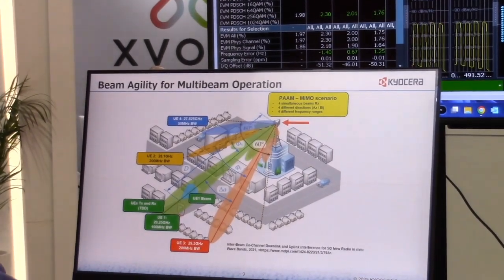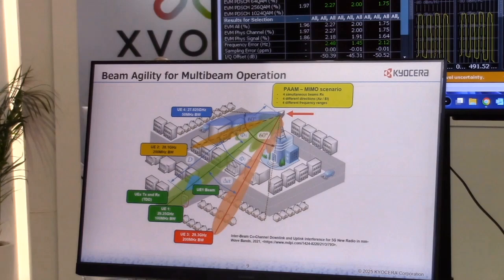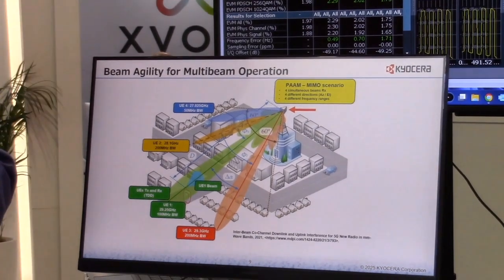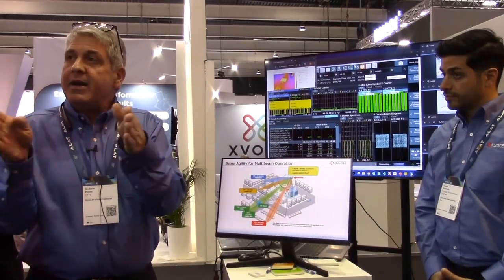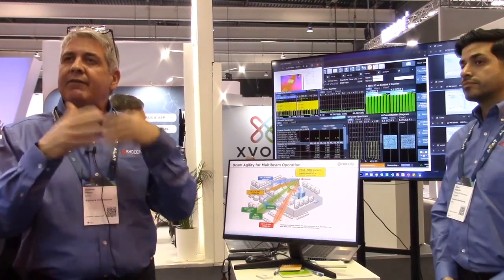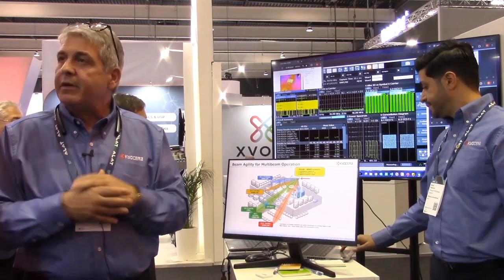We believe this is important as we approach these multi-beam deployments, so that many beams can be operated simultaneously and you have the ability to shape the beam and to lower the side lobes to minimize beam coupling. It's sort of an analog pre-coding that's layered on top of the digital pre-coding, to alleviate some of that digital pre-coding processing in the back. That's what we've been asked to do.